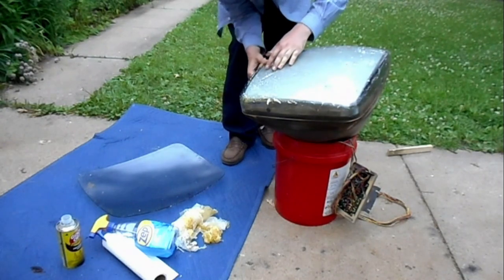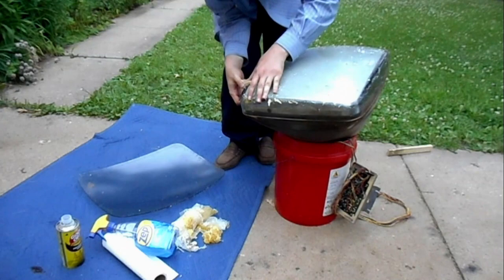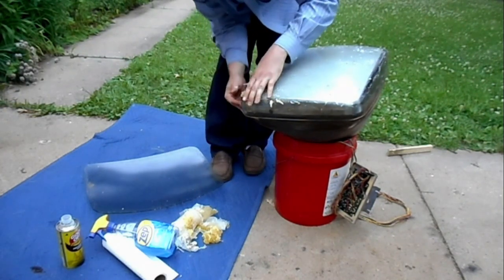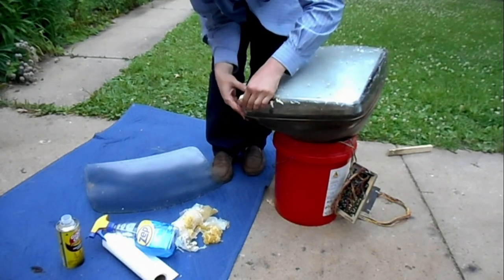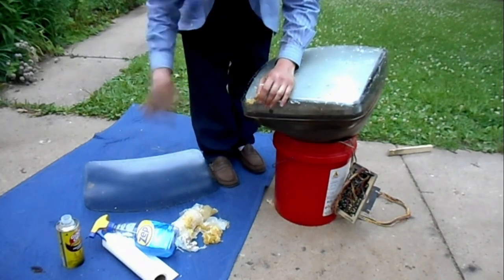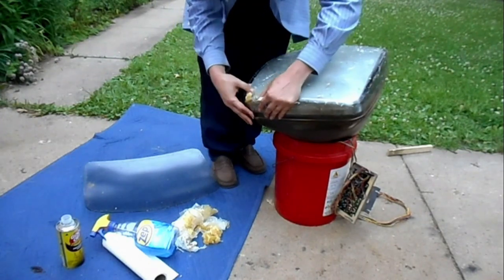The reason I consider heating a tube so dangerous is back when I was experimenting trying to find a technique that worked for me to cataract RCA CRTs, the first tube I did, I ended up cracking the safety glass off of it and having a patch of safety glass and glue in the center that was stubborn.